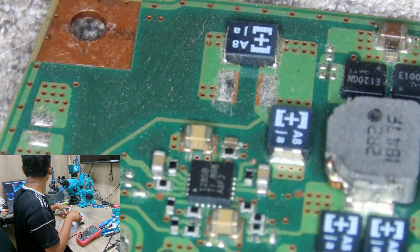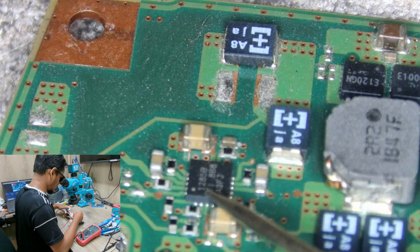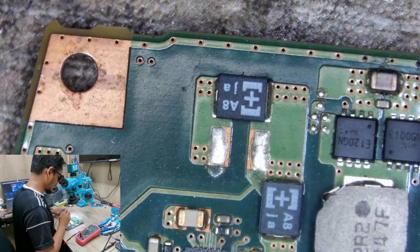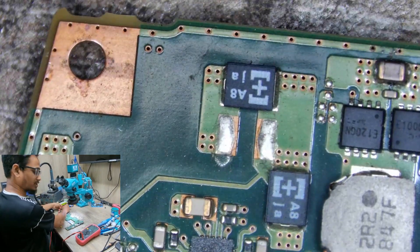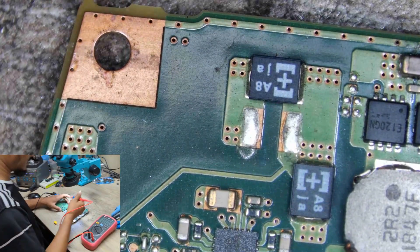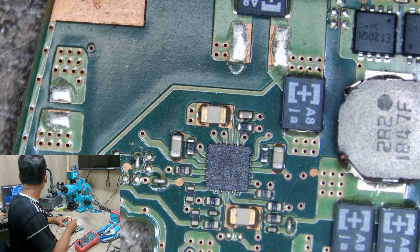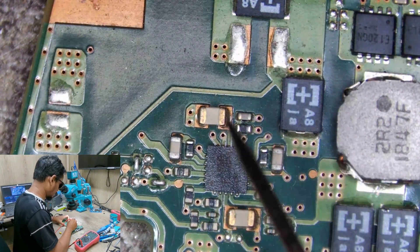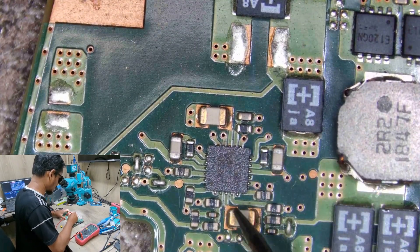I found controller 1285 — this is the 3V and 5V regulator IC. I'm going to plug it in and first check the LDO voltage: 3V and 5V. I'll check these two capacitors, though I'm not sure which is 3V and which is 5V, so let's check here.